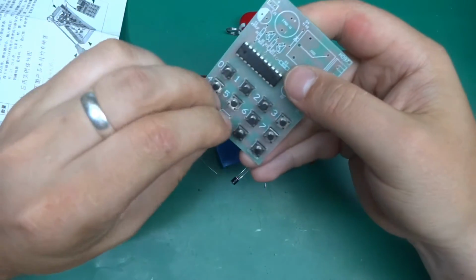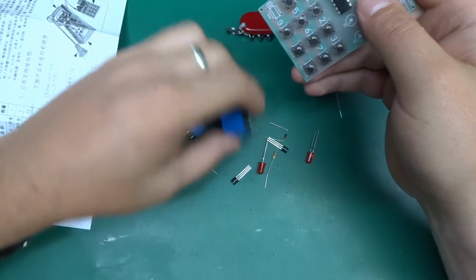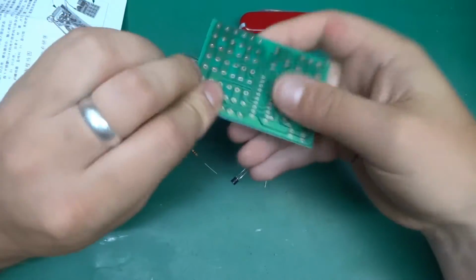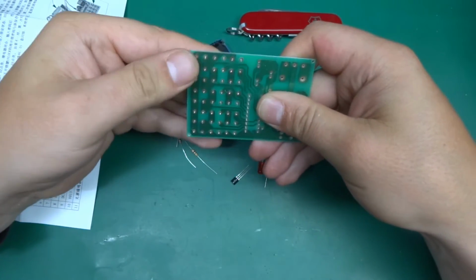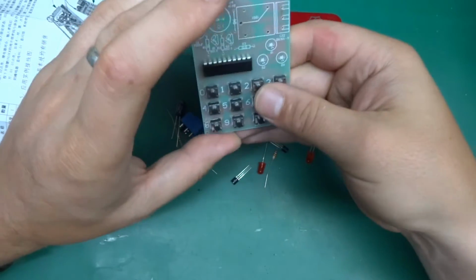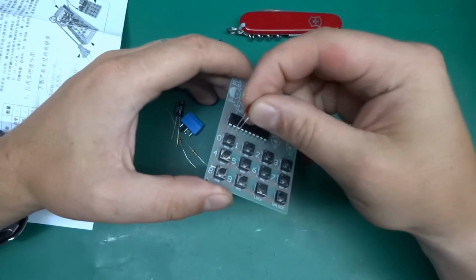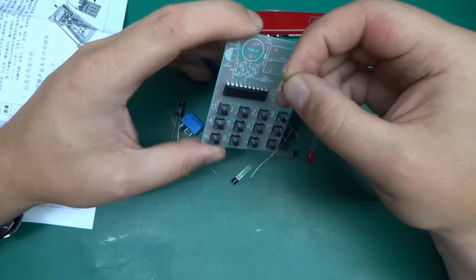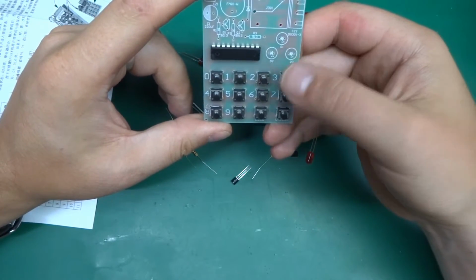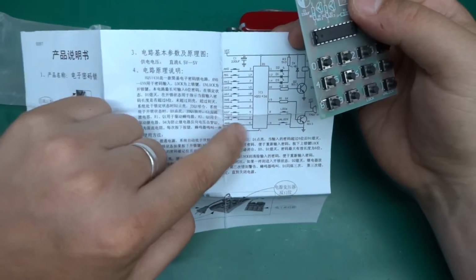It's a very purpose-built chip, this thing, because you could see the schematic. You saw on the schematic there's literally nothing special about the whole thing. And what's even stranger is that the keys are not even multiplexed. So they've got a lot of pins, well, how many pins is that? 1, 2, 3, 4, 5, 6, 7, 8, 9, 10. So a 20 pin DIP package, and they are basically wasting 12 of the pins for the buttons, because each button, as on the schematic, is just pulling a leg to the ground.